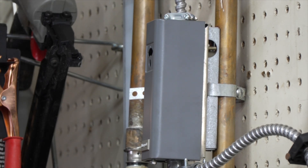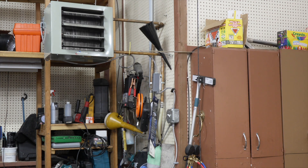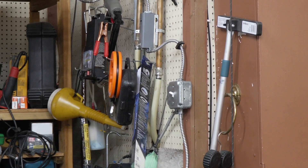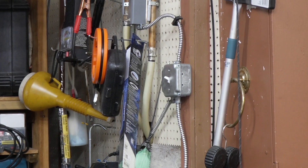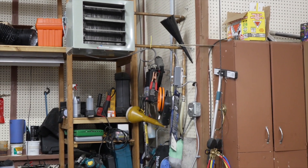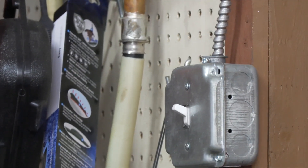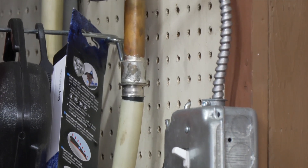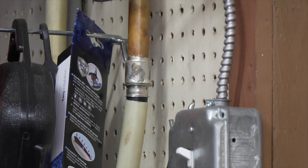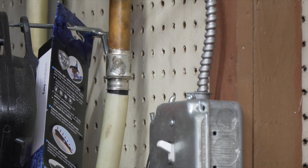The next part is getting the copper pipes into the basement to the boiler. Originally I was going to use copper all the way there, but the guy who does my boiler maintenance said why don't you use PEX? So what I did is something called PEX-ALPEX, which is aluminum-based PEX. It's not for drinkable water—it's for this kind of hydronic system. Right there is the copper going to the crimped PEX-ALPEX, which is the white stuff, and it goes down and across. I had to drill into the basement from here.